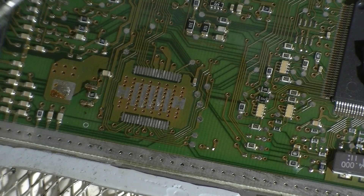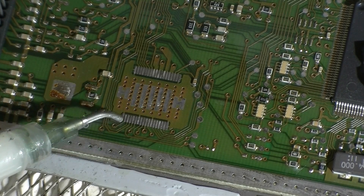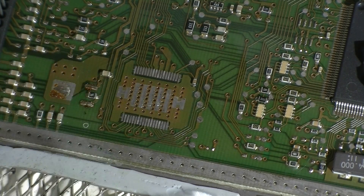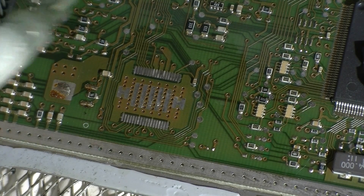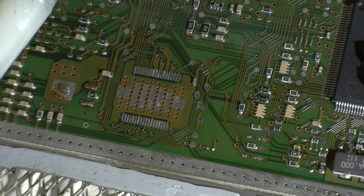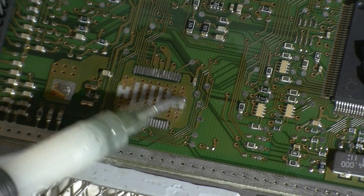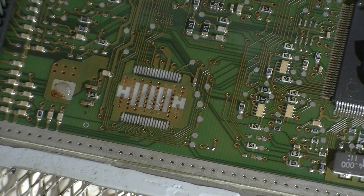So how are we going to do this? Because there's no solder mask in between these points here, I'm actually going to solder them manually, because that'll be easier — otherwise they'll short together. So I'm going to apply a little bit of gel flux here, over there, over there. I'll set up the other iron as well and just place that underneath.